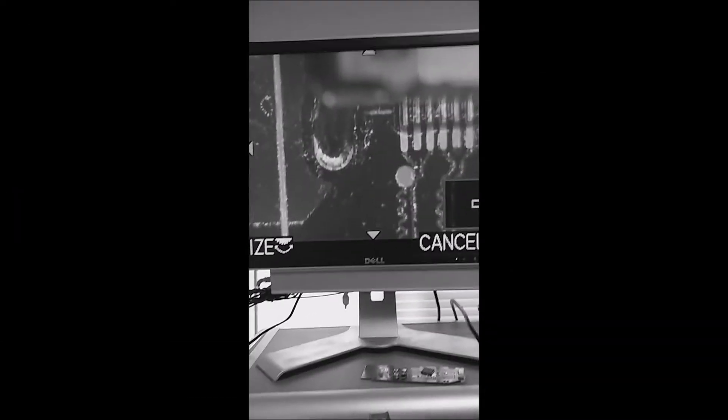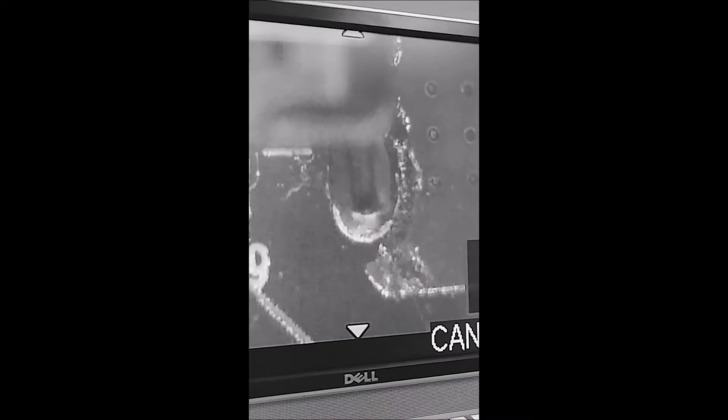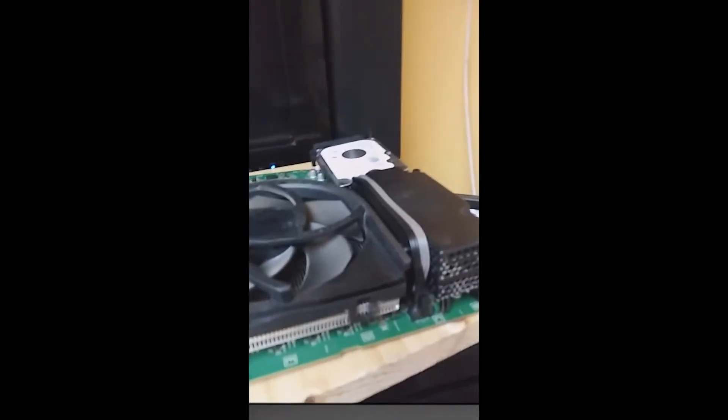As you can see here with the legs soldered on properly, you see that puddle — it's got the solder in. This one is probably 90%; it actually needs a little bit more to cover that. But if we take a look at the other side of this board, you'll see that is a proper leg — this one is actually a little bit extra, maybe 110%. Over is better on legs; under is not that good because then you don't have a full solid port. Now we've got everything connected to the HDMI port and we're going to give it a whirl.